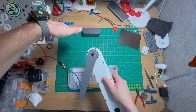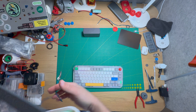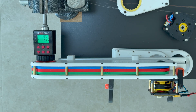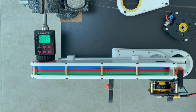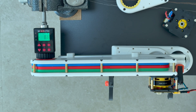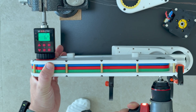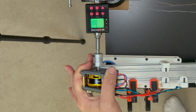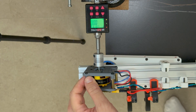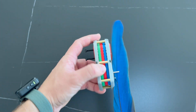And it spins surprisingly well. I have no idea why, but the torque is actually higher — about 6.5 Nm. I expected it to be less efficient with the same settings. But the maximum torque is much lower because the PLA plates flex and the gearbox starts skipping. Sadly this torque adapter isn't sensitive enough to measure the motor on its own and I also broke my scale.